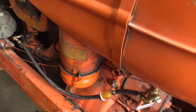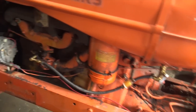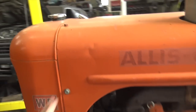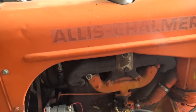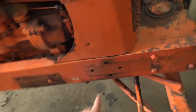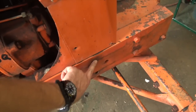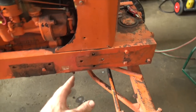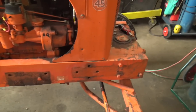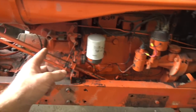Reproduction ones exist, but they're probably a lot of money, and who knows if they're actually any good. So I wanted to use what I went ahead and picked up. I didn't really want to drill holes in this hood, partially because then we have to run wires right next to the engine, and also because this is mint 1950s sheet metal — it's got some dings and dents, but I don't want to mutilate it any more than I have to. So I said, why don't we just stick the lights through these existing holes that were for some kind of bracket, because this way they're shining right ahead of the tractor, right where they need to be. That's a semi-modern positioning for them as opposed to sticking them way back here.